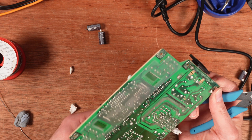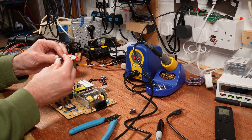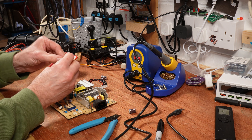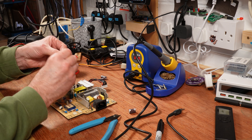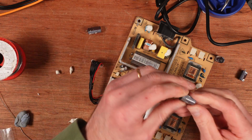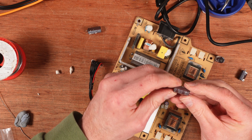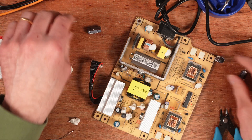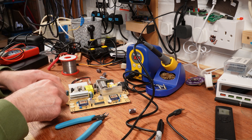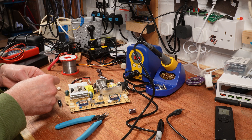Single-sided board, so of course they desoldered nicely. Make sure that's a 1000 — it is. 105 degrees. What were these rated? These are 105 degrees. So they might not be the same brand but they'll be newer.